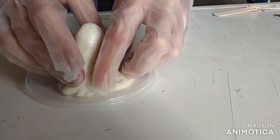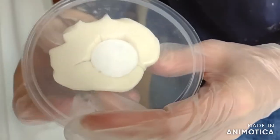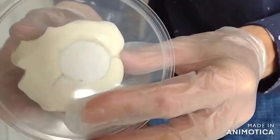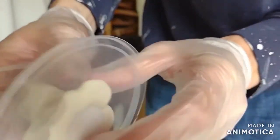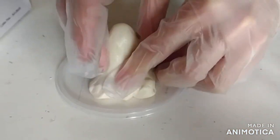No mold release is needed for the mold making part. When it is in putty form, the putty will stick to your part, so you can do pieces on the wall or even on the ceiling. And when it hardens into a pliable rubber, it will not stick to most surfaces. If you want, place your part in the freezer to cool it faster.